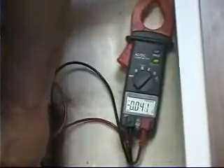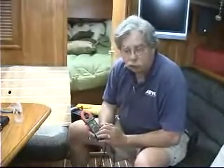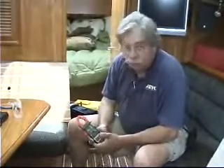You can see that I'm getting literally microvolts, which is nothing. So what sort of a voltage reading would you get on your meter if there were a problem? I'd say anywhere from one volt up to as much as 12 volts. 12 volts would be a very profound amount of leakage, and even one volt could still do some damage over time.